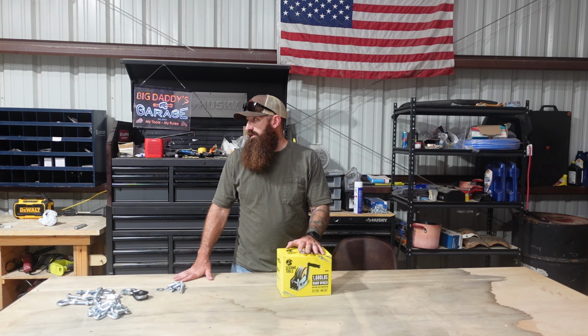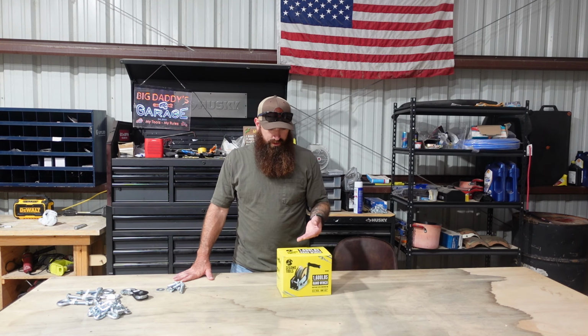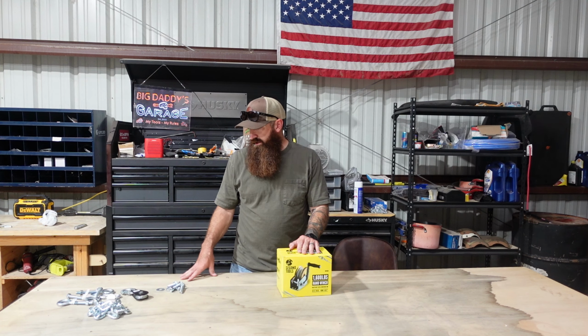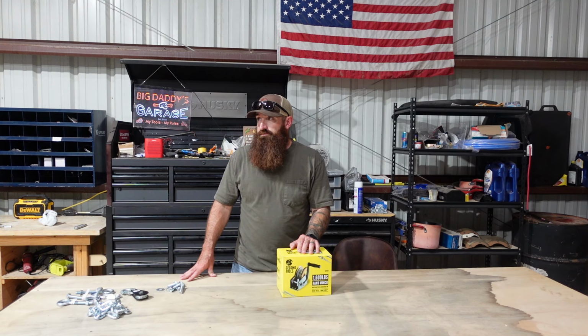I have more room in here now than I did last time, so it might not be so bad, but I think it'd be a better storage option to hang my camper shell from the ceiling. And it probably only weighs 200 pounds or so, and this is rated for 1,600 pounds. All this chain and pulley and everything is up over 1,000. So I went way overkill, because camper shells are expensive and I don't want it to fall onto the ground.